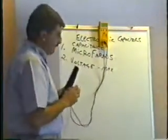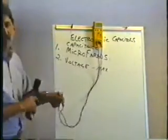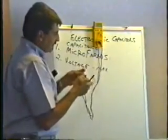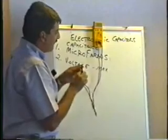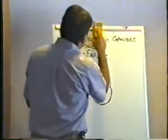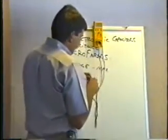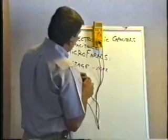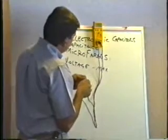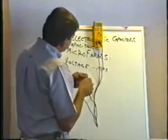Here's what they do. They put the meter on some kind of an ohm scale — like the 2K scale or something — depending on the size of the capacitor, and put their meter leads across the cap, positive to positive, negative to negative. Then they watch the meter charge up. Let me go to a different range so you can watch the capacitor charge up on the meter: 0.1, 3.3, 0.4, 6, 7, 8, 9...